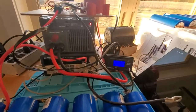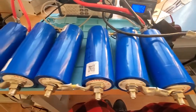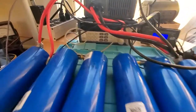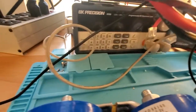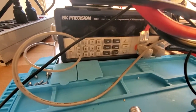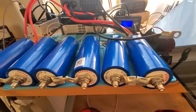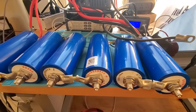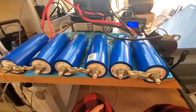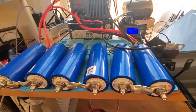I've got it rigged up to where I can charge six of these in series. Afterwards, I use this BK Precision 8500 programmable DC electronic load to measure the individual cells. Most of them are producing about 40 amp hours, so it looks like I got a good buy from OAN, who I bought these from — I bought 150 of them from them.